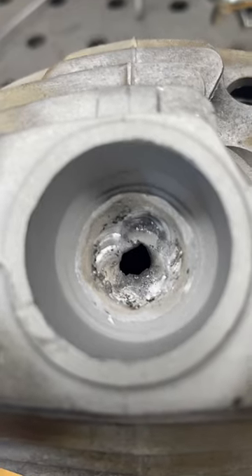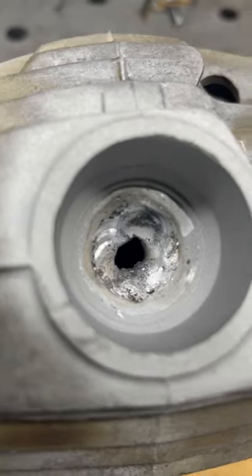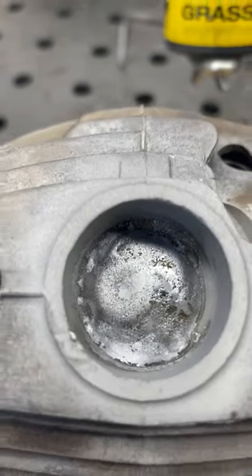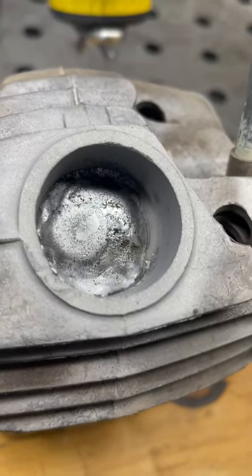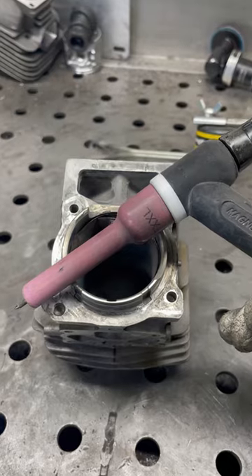Managed to get a decent root in with a lot of burn-back, or burn-through, so we got material in the chamber that we can blend in. Here's the weld all built up — we overbuild it so that we can knock it down slightly and start the threads in nice, then finish it off to the final height.